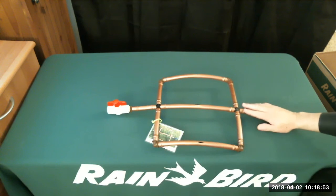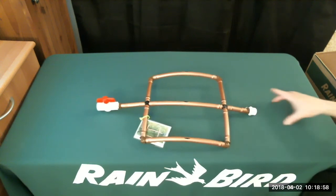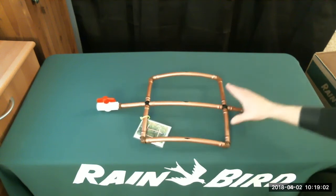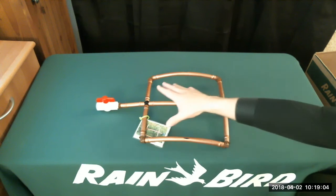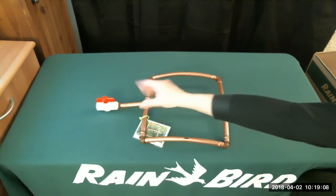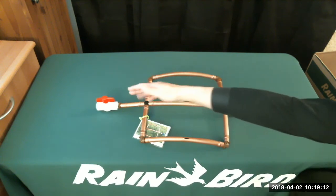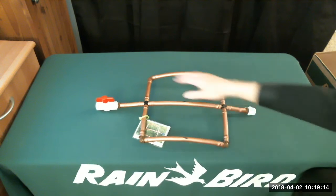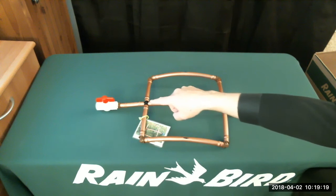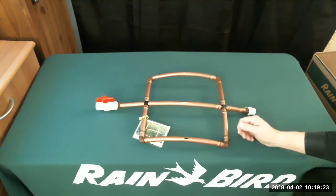So when you go through this, you're going to tell them we have a control zone kit on this end. And then this is a supply header. It actually supplies the water to the drip line. And then this is an exhaust header, and that's where the flushing action is going to go because it's an exhaust. So you have supply and you have exhaust, and then you have a manual flush. You do not need an automatic flush valve. It's not required.